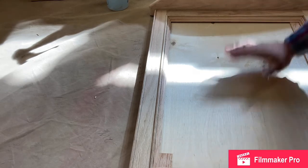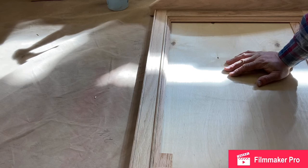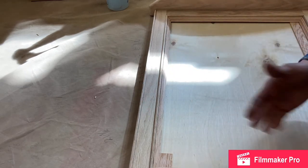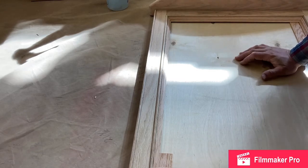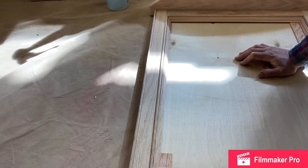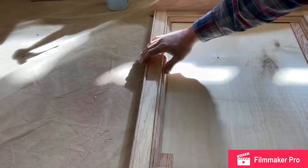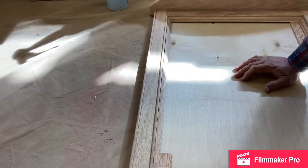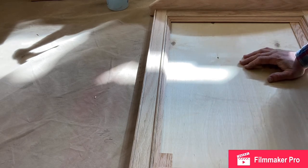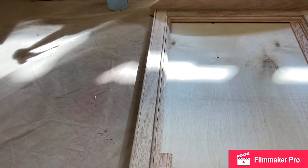Anyways, on our next video, what we're gonna do is we're gonna go over how to go ahead and mount these in. We're gonna use a minimum amount of brad nails. We're gonna put it in with an 18 gauge brad nailer. Probably gonna use 1-inch nails. If we can find smaller, we're gonna try to use smaller. Just the minimum amount. We are definitely going to be using some glue to help hold these in, because that's what we really want to hold it in. The nails are just gonna hold it until that glue sets. But I'll tell you what, I'm really excited about this, and I'm really excited this project's almost done, to be honest with you guys.